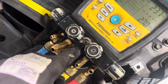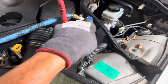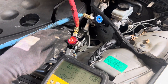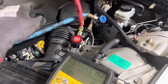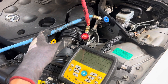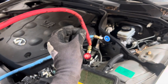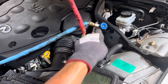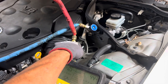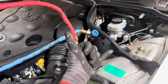When you look down inside your refrigerant sight glass, you can see there's absolutely no liquid flowing being pulled backwards through the vapor line. Liquid and oil can come out of the compressor — as it lowers pressure it turns into a foam, just like whipped cream pressurized with nitrous oxide, or Coca-Cola when you lower the pressure and it all bubbles up. Same thing as adding a Mentos inside Coca-Cola. You can literally lower the pressure and it all flashes into a foam, coming up the refrigerant pipe as a semi-liquid foam, removing oil with refrigerant.